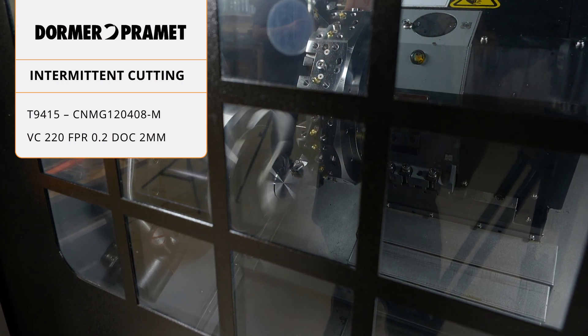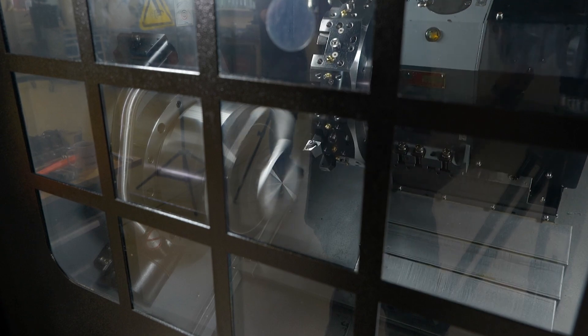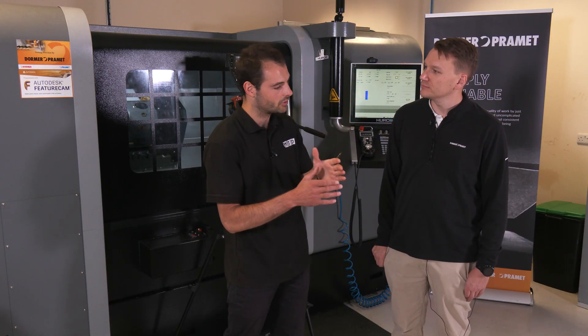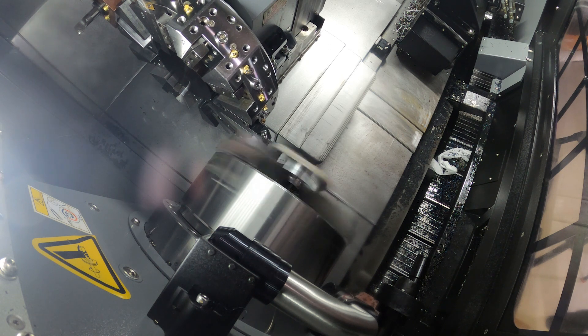We're running it dry — it's sparkling a little bit but producing nicely colored chips. We're going to be doing quite a few passes, maybe three or four more to go. Because it's a square part, it's going from intermittent to continuous cutting, and once it gets to continuous you should get quite a nice finish. You can hear that intermittent cutting — you'll get a nice finish once we break through.